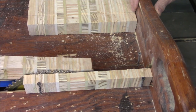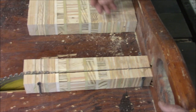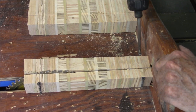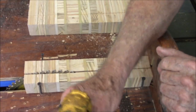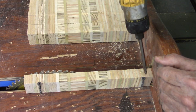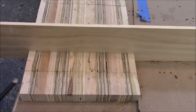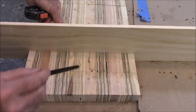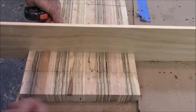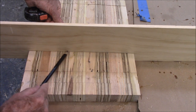I've had to stop the saw for that reason right there — see how it cramped and clamped in there? That's because the wood is clamped against the blade, and you don't want to be pulling that thing back because it's going to pinch. I need to take these screws out. What I've got going is putting some of this three-eighths-inch material down between each one of these boards. Now this is 12 inches across — this big board here is 36 inches long so it's just barely going to fit. I'm going to want those boards to be about that wide for this one.